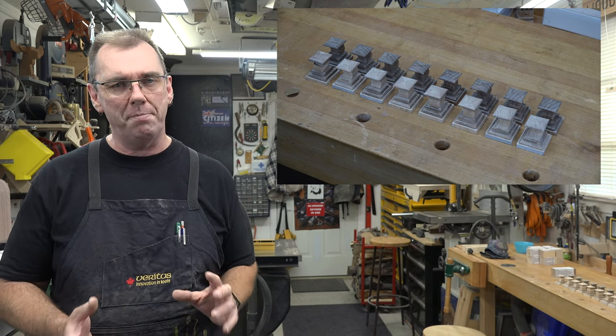Now with all of those tight corners here where we drilled blade entry holes, if your blade is not square, they are going to be cutting crooked. And when that happens, on compound cutting, they're not going to line up. So one's going to be this way and then it's going to be this way. You can see how this is going to cause problems. If your blade is square and you continually check it to make sure that it's square, you'll end up so that all of those pieces all line up around the edge. And you end up with a gorgeous piece. Just look at that. That is beautiful.